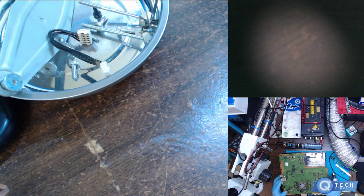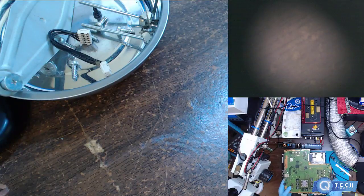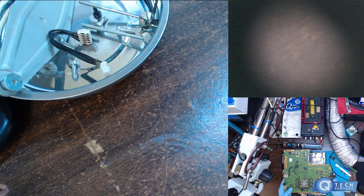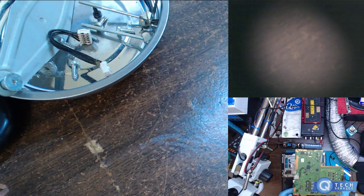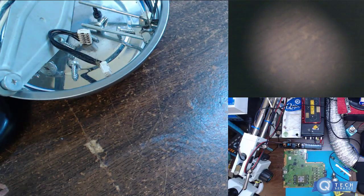Yeah, probably a new APU. Nah, I don't think it's... usually with the case of these, it's actually the solder balls come detached from underneath the chip, believe it or not. Yeah, but sometimes if the reflows don't take, then it needs a reball, which I'm definitely not going to do. Unless it was somebody's data, they wanted their data off the PlayStation 4, it's not worth it.